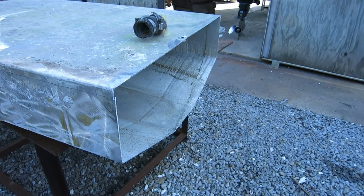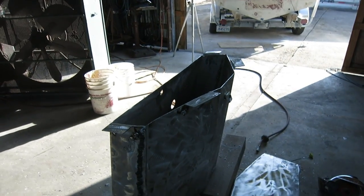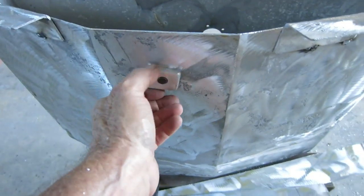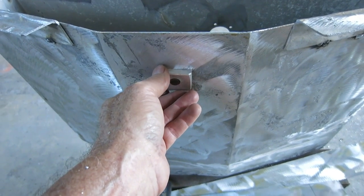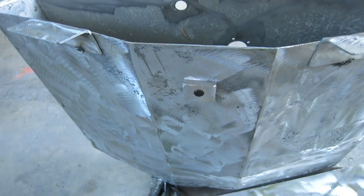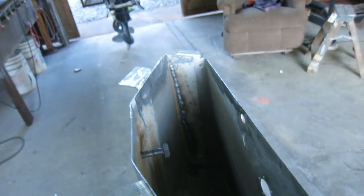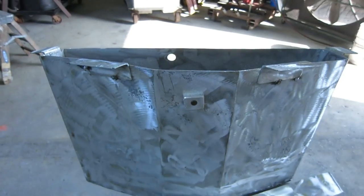I took a slice out of this side of the tank to get some clip angles, and I cut the other end of the tank to get material for the other end of my little flotation pod. I'm not trying to seal this up totally because I want to stick some foam in there, so I'm going to cut this down to this pencil mark. I took a piece of heavier aluminum and drilled and tapped half by thirteen - I'm going to weld that here; this will be my drain plug. The bolt will come from the other direction and will need a gasketed head because this is not a tapered thread. I've got a couple of little squares cut to plug two holes and the end cut, so a bunch of welding here - not my strong point - but I'll muddle through and you can always seal it with epoxy.